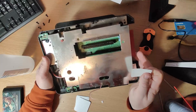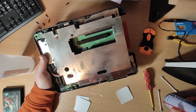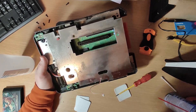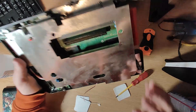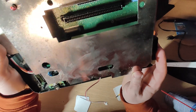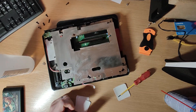What I'm doing now is I've just sprayed in some electrical contact spray — probably a bit too much actually — but you can see how dirty these Q-tips are getting. To me it looks like there's something inside one of those slots, so I'm going to need something to pick it out with. Let's see what I can find.